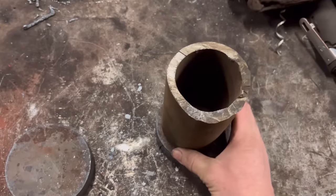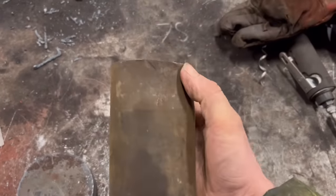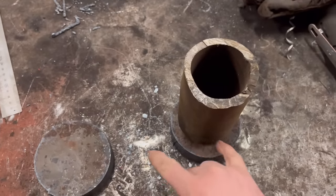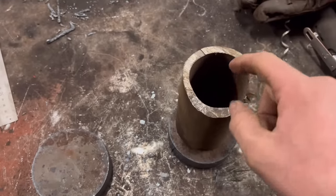So I know that's bang in the middle of that. Do the same with this one. Well, obviously I'll have to cut a bit off this and neaten it up, and then weld them both on. And then after it's all welded up, then I can bore the holes through the middle, and then I know that that hole will be dead true to this hole.